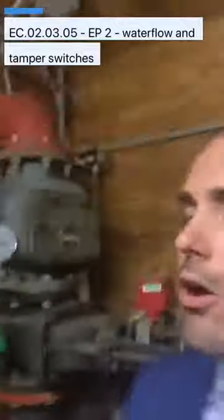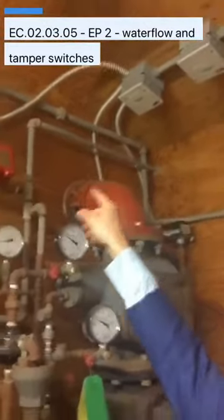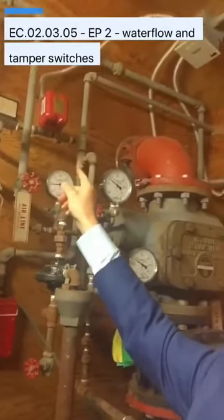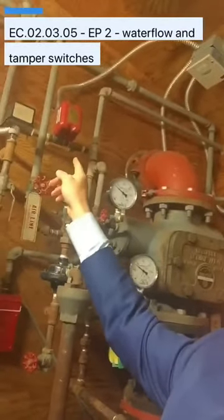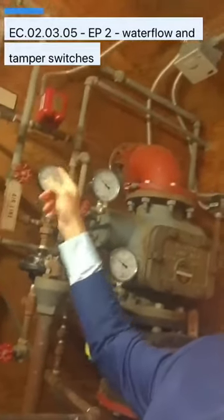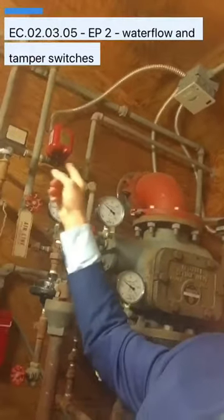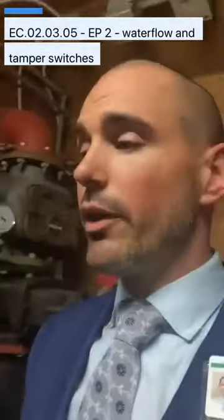It's really the same concept for our pressure switches. As you recall in the EP1 video, there's a high-pressure switch for us — it's a water flow pressure switch, and we've got the monitor module up there labeled for it as well. EP1 is for supervisory signals and doesn't require quarterly testing of high-pressure switches. This is an alarm device, not a supervisory device. But it's the same concept — we don't want the technicians tripping this pressure switch. We want it to be natural, how it would actually happen in the real world.